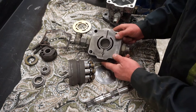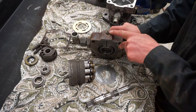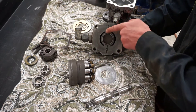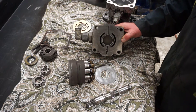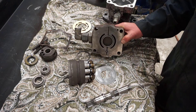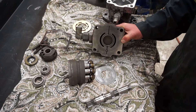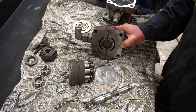Another clue is this tow screw right here. When I thread it out, it connects the A and B ports together so oil can flow through the unit without it having to turn. For example, if your engine dies and you needed to pull the unit into the shop but it was too heavy or the wheels would skid, you'd unthread this a few turns and the unit would then free roll.